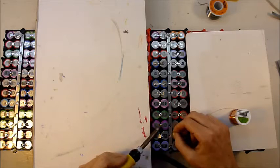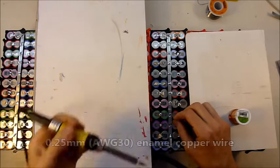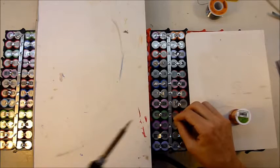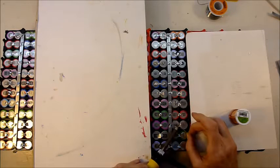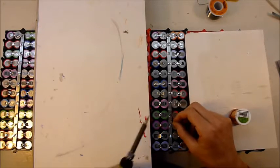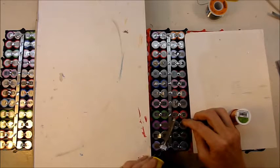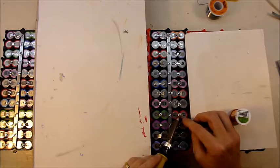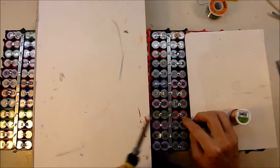If you're wondering why sometimes I seem to wiggle my soldering iron back and forth, I'm just helping to scrape and burn off the enamel on this enamel wire that I'm using for fuses. It's quite thin wire so it has really thin enamel. It's reasonably easy to get rid of the enamel in order to make a good electrical connection. You can tell whether or not you've burnt it off - it'll flow nicely when the enamel is burnt off. There'll be a nice solder flow effect. Whereas if you don't burn it off, the wire will just look like it's denting the solder rather than having the solder flow all over it.